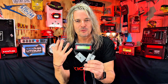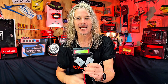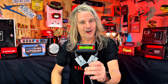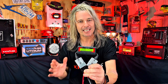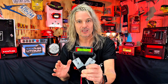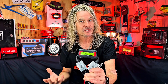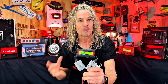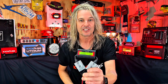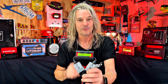The Wattmeter really comes into its own when you need to do a lot of short-term measurements to find out exactly what's coming in and going out of your system. The best thing is being able to target a single device — finding out what your solar panel's producing, or seeing what current a fridge is using. A lot of battery management systems can add it up overall but can't tell you what an individual item's using. So this is really handy for doing your homework and finding out what size battery bank you may need.